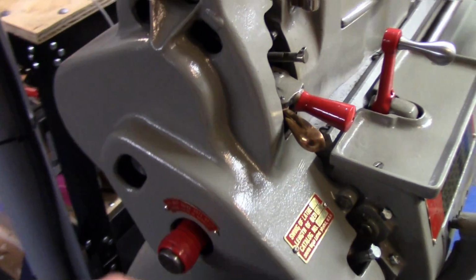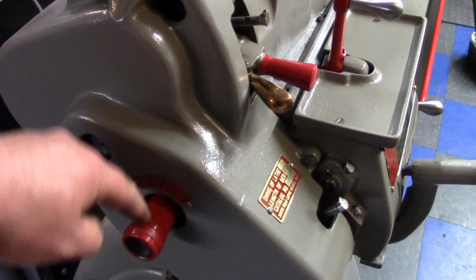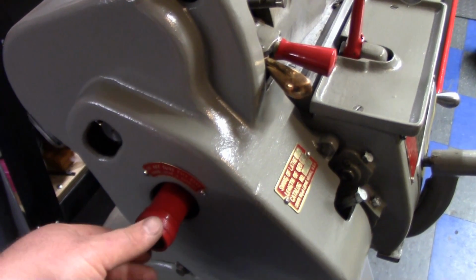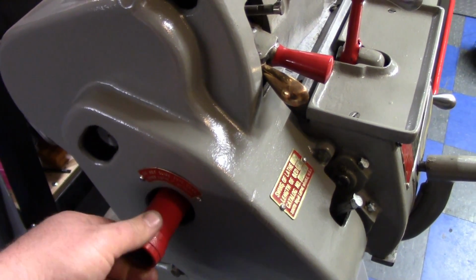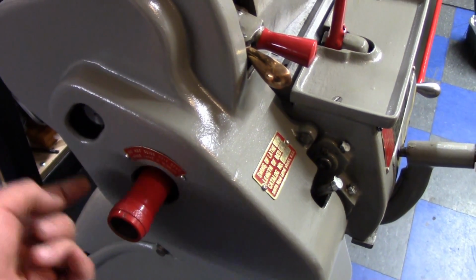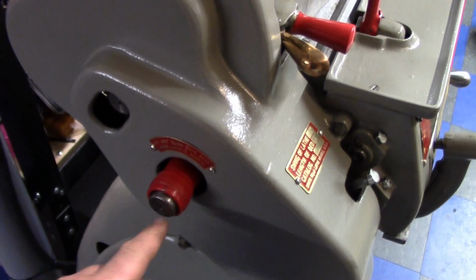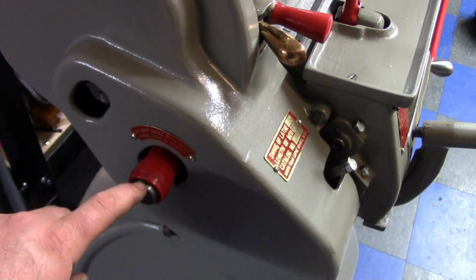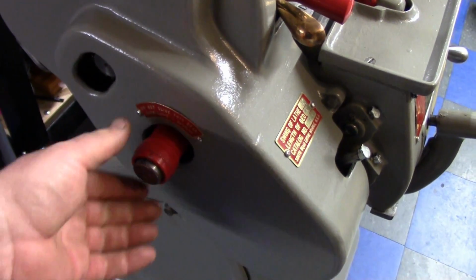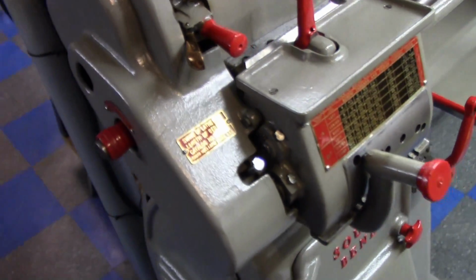This is the sliding gear I have to remake. There's a little ball bearing in there with a spring, a clamp spring on the outside. That spring is broken, so the detent doesn't grab. And also one of the tracks for that ball detent is a little scored. So I don't want to remake the whole shaft. What I might do is just get this down to a nominal size, make a sleeve, put the sleeve over it, and then remachine those grooves into it. And that should take care of that.